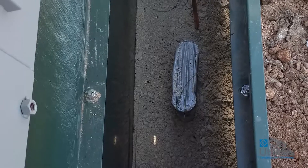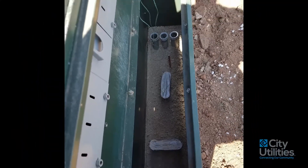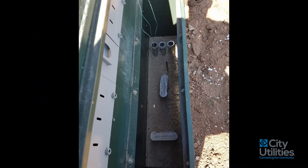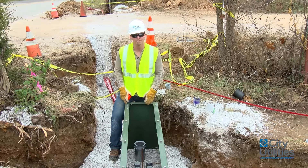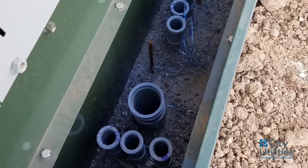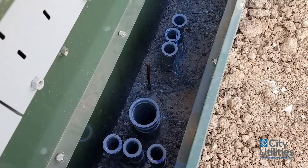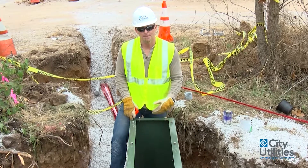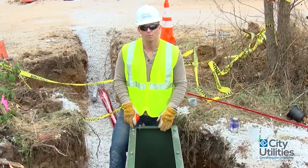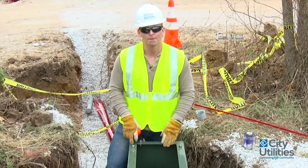Here are some examples of what you might find inside. It may not have a riser coming inside of it — it may simply be three pipes coming in and three pipes going back out because the run was longer than 500 feet. Or you might see a four-inch in the middle and three pipes on one end and three pipes on the other. You're going to have to get with your engineer or your inspector to clarify the purposes and how this junction cabinet will benefit the utility in its proper perspective and what it is feeding.